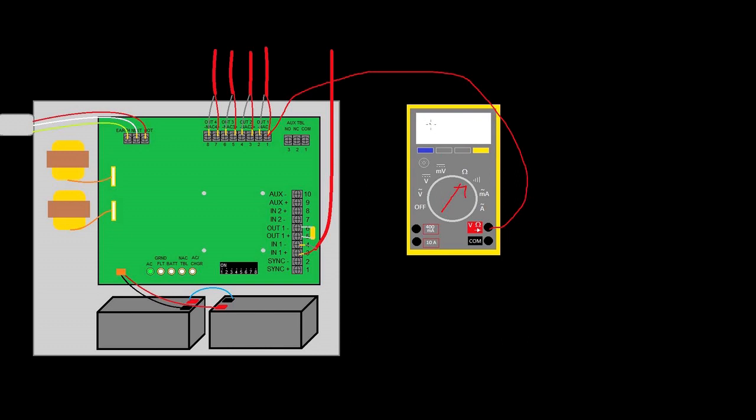So we're on resistance now. Let's say the meter reads OL. I've been doing this a long time — I don't know if that means 'open line' or what — but essentially it means infinite resistance. There's no continuity at all across that pair. I'm going to go on a brief tangent. When I was new at this and troubleshooting an open circuit, I was going junction box to junction box. At one point I metered two wires, got OL — as big of an open as it could possibly be, like you're metering the air — then came back, metered it again, and instead of OL I had something like 256K ohms. I thought, wait, I could have sworn I just had OL here. How did it change?